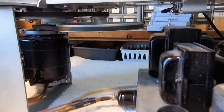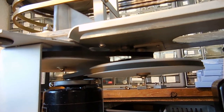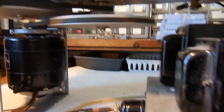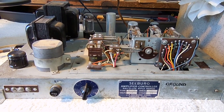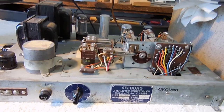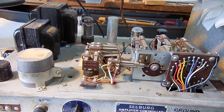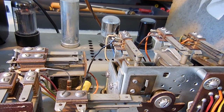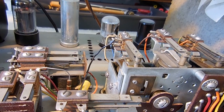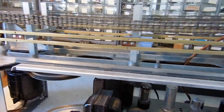Here I just have the tracks. The motors on the left have got a double reduction pulley and a cogged belt so there's very little slippage. The motor turns one direction and can be reversed by the amplifier. Here's the amplifier. The two relays on the left — the one right in the center of the picture controls whether the game is on, and the one just behind that controls the direction of the bear. When you press down on the far relay on the right, that light makes it look like a hit, and when it hits that relay on the left in the back will pop and the motor reverses. Take a look at the pulley and you can sort of hear it click and hear it go back the other direction.